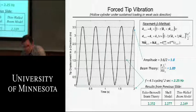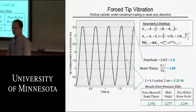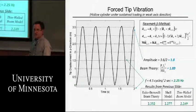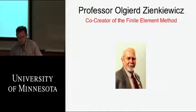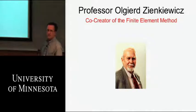Now, I will be talking a little bit about the commercial tools that are available to solve problems of that sort. There are commercial tools of general application. They can be used in various structural applications, including turbines. But there are also those that are designed explicitly for turbines, and I will mention those efforts as well. Before I do, they're all based on the same kind of concepts of reduction of something that is continuously changing to something that is represented by a certain number of values. This process of going from continuous change to discrete change is called discretization.